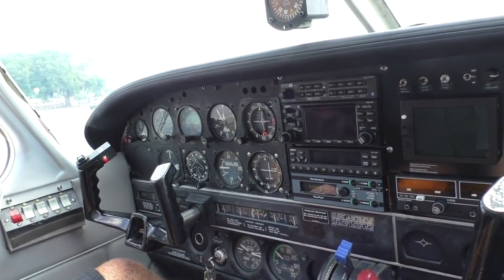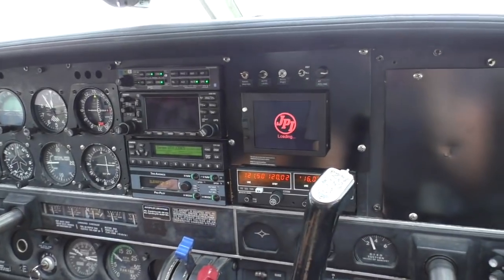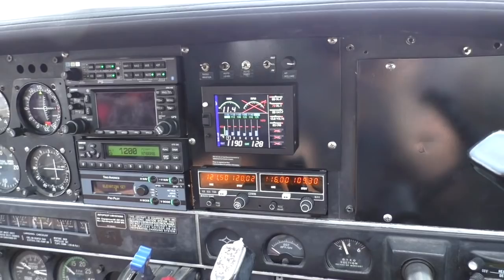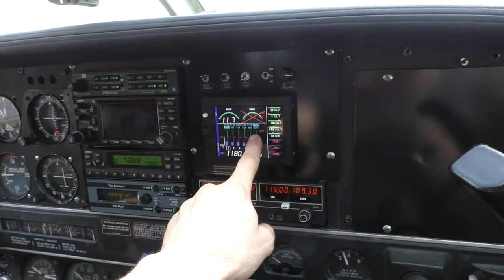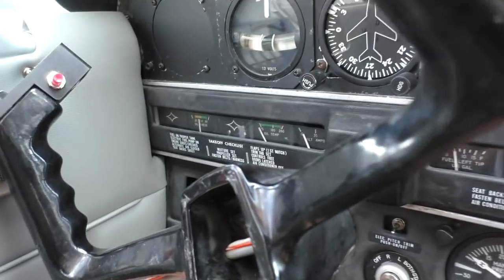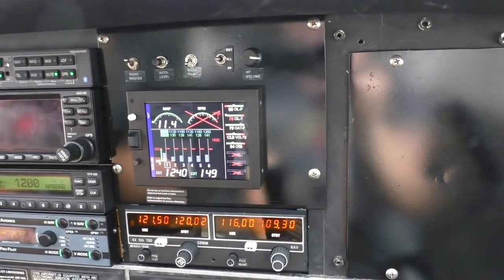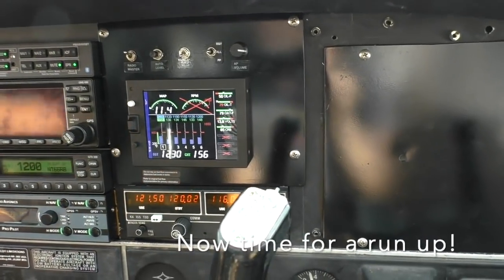You want me to turn the avionics on so we can get some engine parameters? Number 6 cylinder is showing temperature — that's the one we were worried about that was oil fouled. Oil pressure 50, showing about 50 over there, so that's good! There's the regular spring with no washers. And there's no RPM sensor — no RPMs! So we'll check that out, we're going to get one of those scoping things.